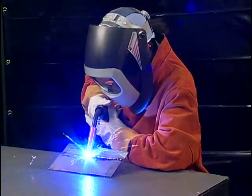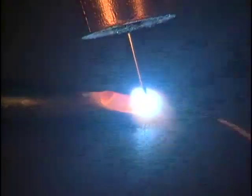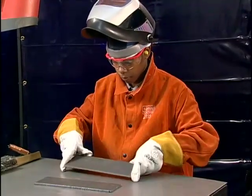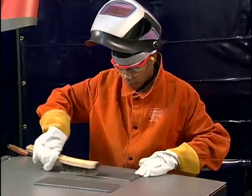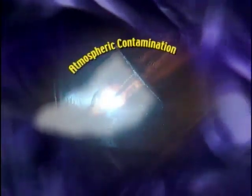Now let's review the key segments of the program. One: by far the most common transfer mode is short circuit transfer, which can be used in all positions and on metal thicknesses ranging from 24 gauge to 1/4 inch. Two: appropriate work clothing is required in any industrial environment — in a welding shop, to protect yourself from burns, clothing must provide as much coverage as possible, be tightly woven to block out light, and must not burn easily. Three: shielding gases in the gas metal arc process direct a gaseous shield into the weld zone through the gun nozzle, protecting the weld pool from atmospheric contamination until the molten weld pool solidifies. Thank you very much for joining us.